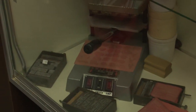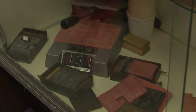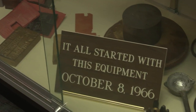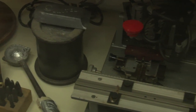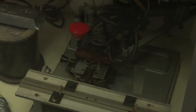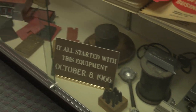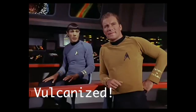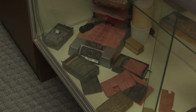Yeah this is it. In 1966 this is the equipment I bought — a little vulcanizer, a little pantograph engraving machine. Took it home. In those days I had to set the type one letter at a time, heat it up, force it into a matrix board, and then put that back in the vulcanizer with a piece of raw gum rubber and vulcanize it to make the rubber die. Then cut them apart, put them on a mount and a handle and I had a rubber stamp.